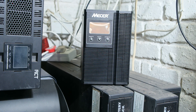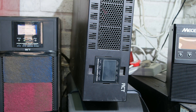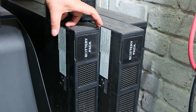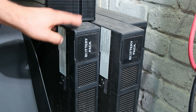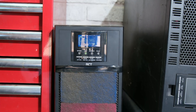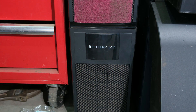Starting with the small unit: it has two 9 amp hour batteries in series to provide 24 volts, which is stepped up to make 230 volts. The 10kVA relies on 16 batteries connected in series in a battery bank. The battery bank looks like this - sometimes they're bigger depending on how the chassis is designed, either tower mounted or rack mounted. So 16 batteries are inside each one of those banks, and I've got one, two, three banks. The tower UPS also has a battery box with 16 batteries inside.